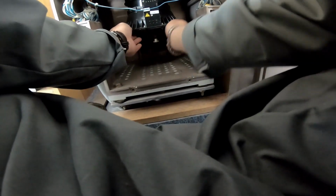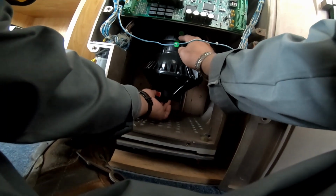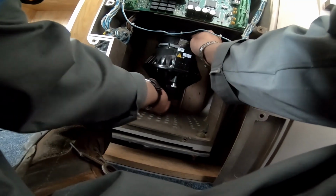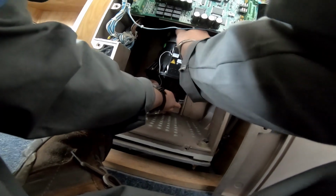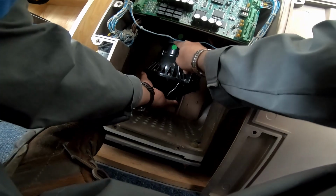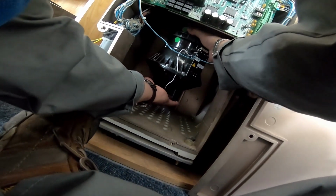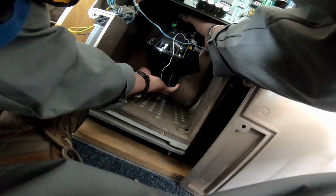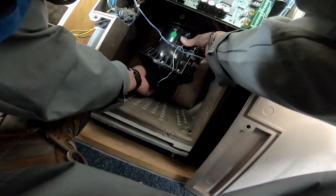We'll remove this. You see this slot? One, and the other one is here. Okay. So what you will do, remove first the connection. Okay. See, take a look on this. You just hold this casing up, this one here up, and watch this pin here. Bring it up, push it up, and hold the pin and twist. Okay, when you twist, it will go down.